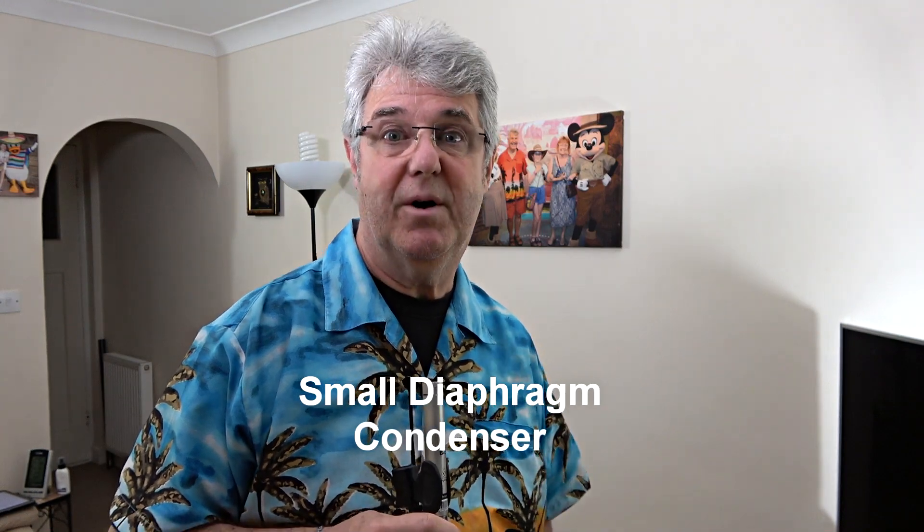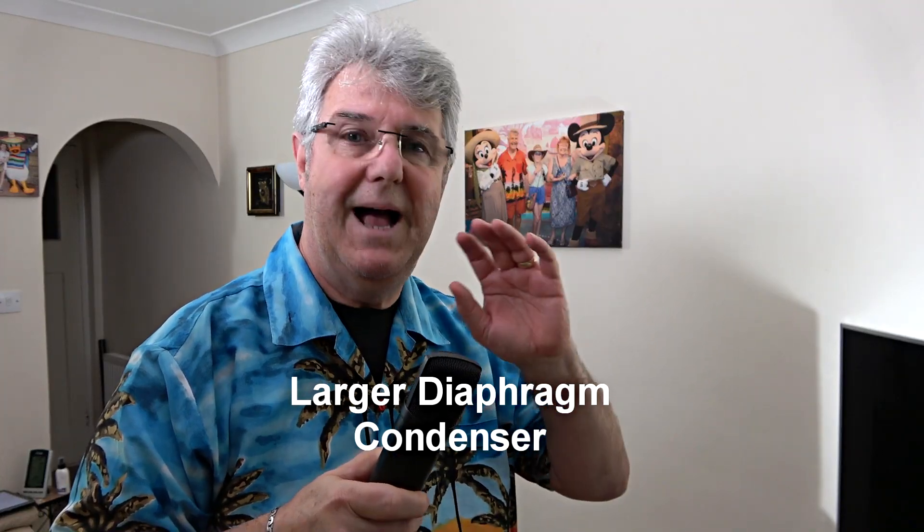This is a pretty typical condenser microphone and it uses 48-volt phantom power. Prices can vary from ridiculously cheap to quite expensive. These microphones are quite a bit more sensitive than a dynamic, but they're very prone to wind sounds and the capsules are very delicate, so you need to protect them outside. That sensitivity means you can turn your preamp down and therefore get less preamp noise.